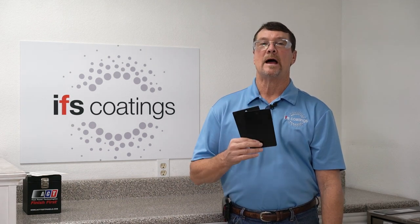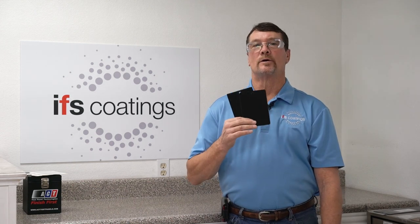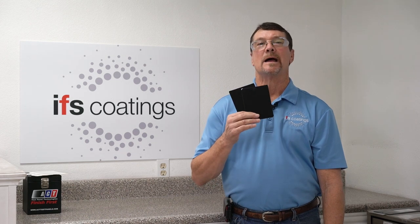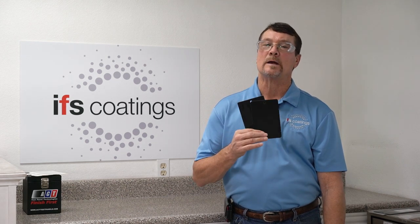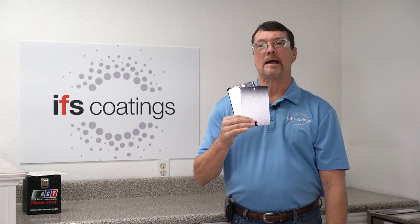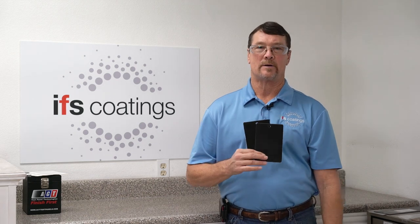You don't want to have excessive flows or too high of a KV or microamp settings. You want to check your gun-to-part distance, because if you get too close you can start getting what we call back ionization, which can also have an effect on the amount of orange peel that you get on a powder coated finish.